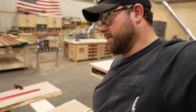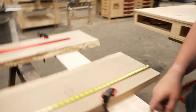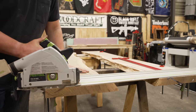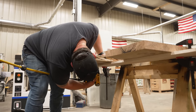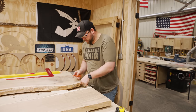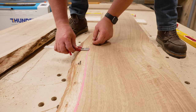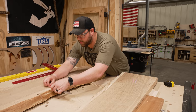One week later. We're super behind on this project — I just welded the base together and now the top is laid out. What I like to do is take a piece of scrap, clamp the table down, and lay out all my measurements. I'll cut the table to length with a track saw after I have it clamped. I might run a couple of 23-gauge pin nails underneath to hold it together so we can hold this sucker on the CNC bed at the right size. Everything is aligned and square, and I'm going to outline where I'd put the glass by hand, take a photograph, and then tool it out on the CNC to get the pocket cut.